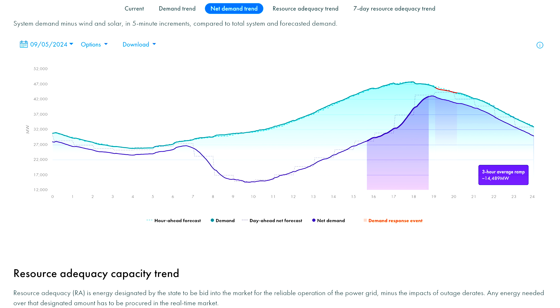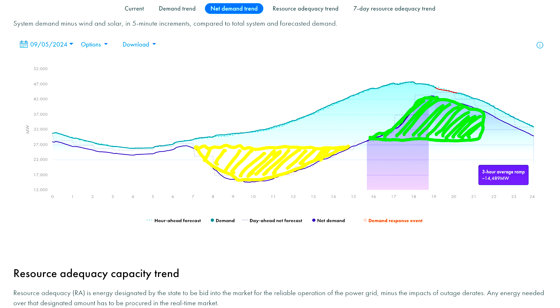Here's what my parents' house was doing. Thanks to the Anker Solix system, instead of exporting to the grid, they were charging their battery. Then their system is programmed to discharge from 4 to 9 PM — instead of pulling from the grid, they would have been powering themselves from their battery. If everyone were to do this, the demand curve would look much flatter. If we want a cleaner grid with no peaker power plants running on natural gas, and room for more heat pumps and EVs, that kind of demand shifting would be critical.